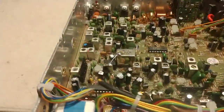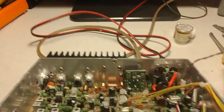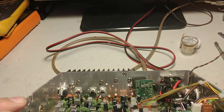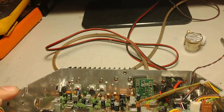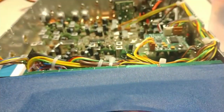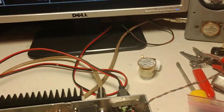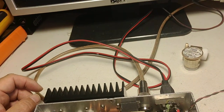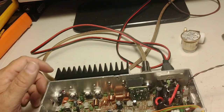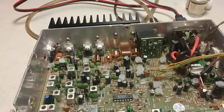One thing I wanted to note real quick — I hooked the mic up. High side power, all the way up. It's a 25-watt carrier out of the box. So it's 25 modulating 60 — that's why we looked like we did on the oscilloscope at about 60% modulation, somewhere around 70%. We're going to fix that for sure. I just want to note that 25-watt carrier out of the box.